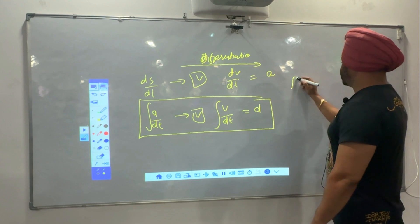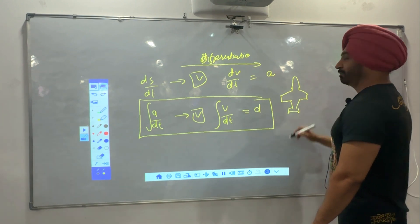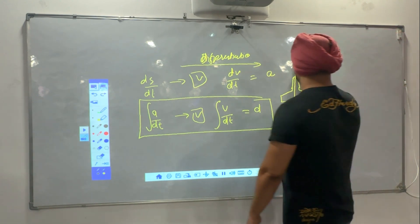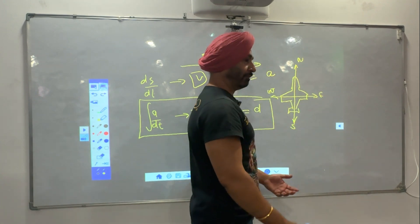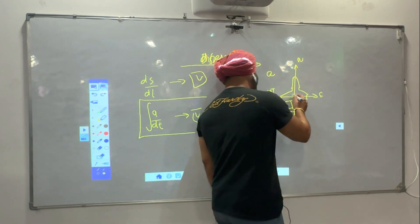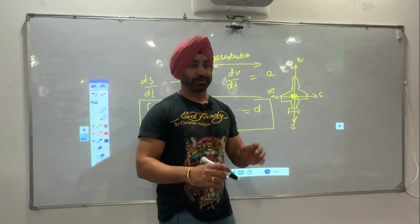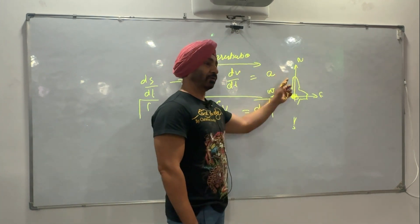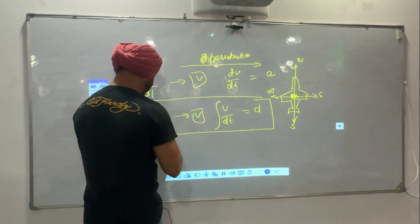So it's a very simple thing. If this is my aircraft, one accelerometer measures in the north-south direction and one measures in the east-west direction. These two are sufficient for navigation, though a third can be added for vertical. The moment you start taxiing, the moment you start moving, acceleration in different directions is sensed. Those accelerometers — one north-south, one east-west — start measuring acceleration. There are two integrators; the first integration gives you velocity.